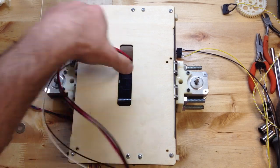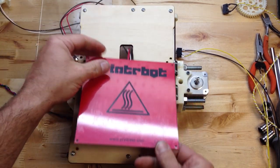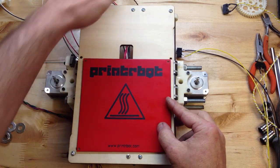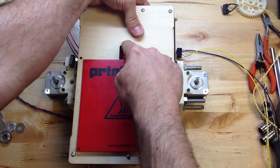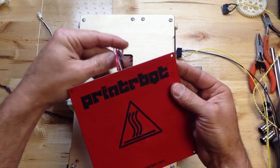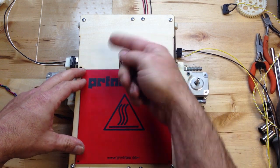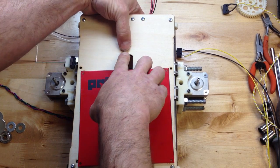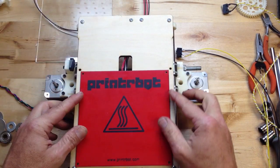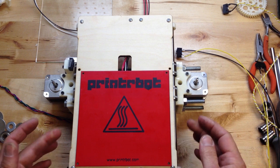I like to zip tie things together, so you can do your cable management later. I'd at least zip tie the wire right here — you might even drill a couple holes there and have this wire affixed to the board, so that when it goes back and forth and bends, you don't want it bending right at the connection point. On all my bots, I actually drill a couple holes there, put a zip tie, and affix it very solidly right here — so that the point of stress is there, not at the connection. Anyway, that's the PrinterBot heated bed, 6x6, and the new board.